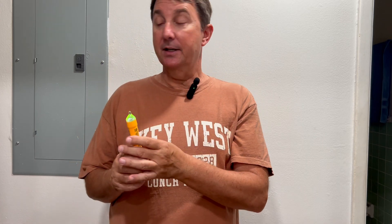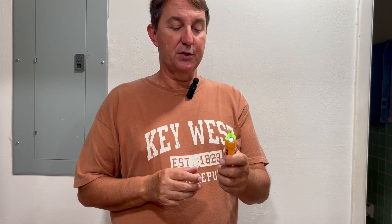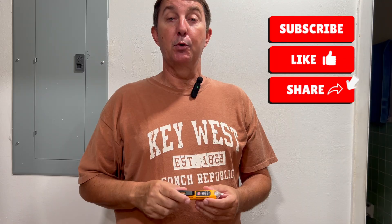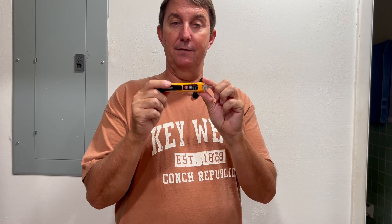Always make sure you have lights before you test anything, and test it on something known, like a light switch. You can put this up against a light switch and it'll show you that it has voltage. Always make sure the battery is working and the system is good before you test it on something and start working on it. That's the reason why a lot of electricians back in the day hated these things — they had no light, no way of knowing the battery was dead. People would test something, go 'the power's off,' but actually the battery was dead — now you get hurt. Very nice tool to get. Thank you for watching — like and share. I'll put links to this and the whole kit. Get yourself one of these, at least if you're a homeowner or a renter.